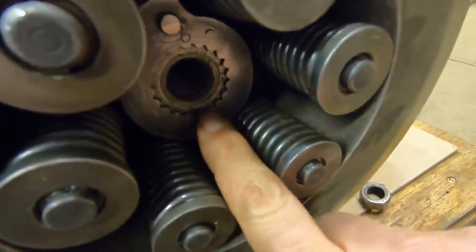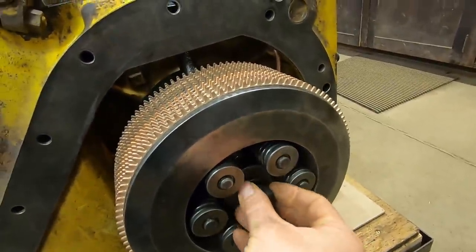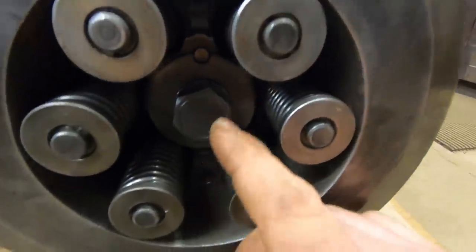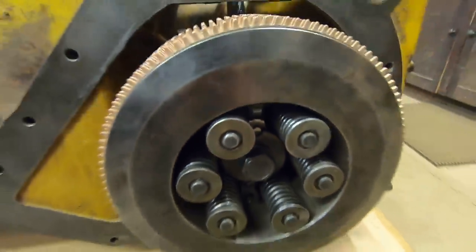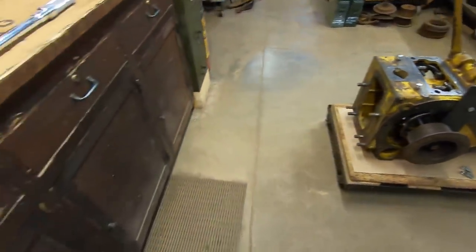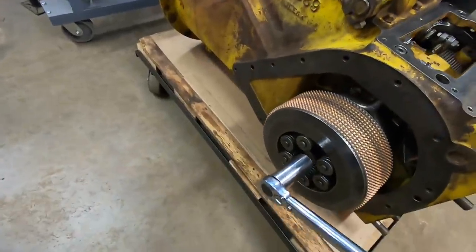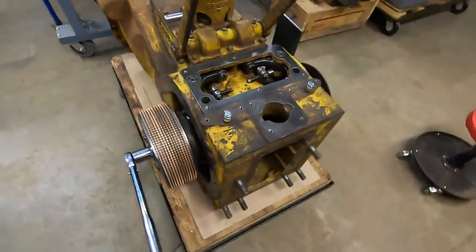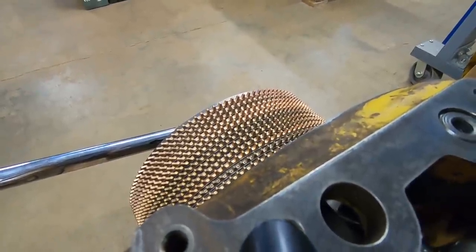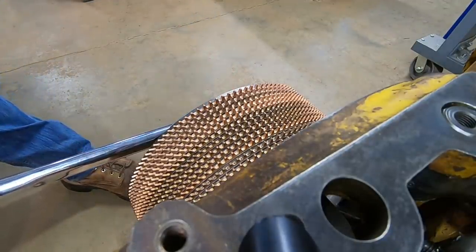Having a look in here — we have a good fit, because the hub is still standing out proud of the end of the shaft. That's what you want to see. We can secure it with the bolt. We aligned the cutout and the flat washer with that little dowel. We can torque that bolt now — I've put my shaft-holding fixture back on the other side to keep the bevel shaft from turning. Going 220 pound-feet; that's pretty well in line with a 3/4 by 16 grade 5 bolt. Our press fit is what installed it onto the shaft — this bolt just retains it.